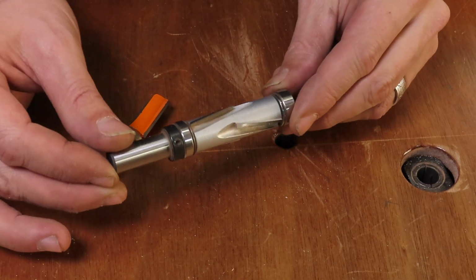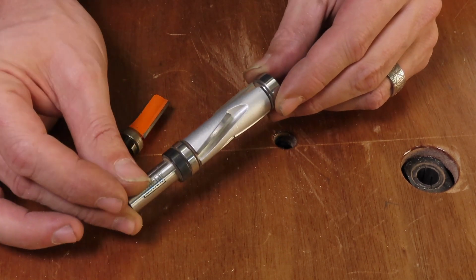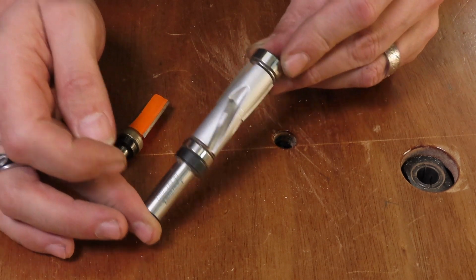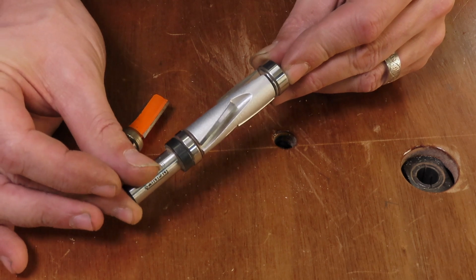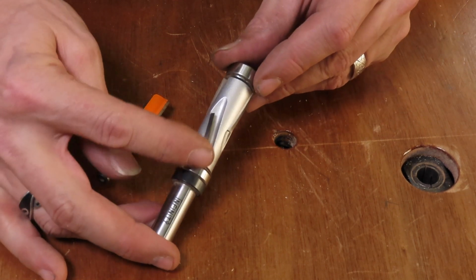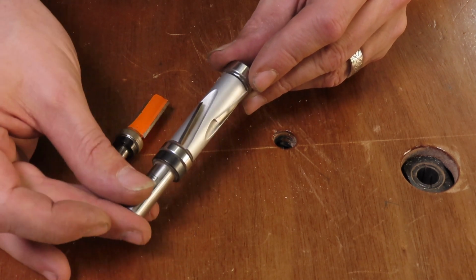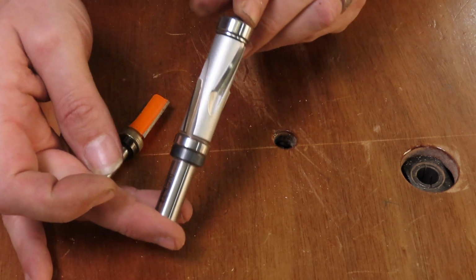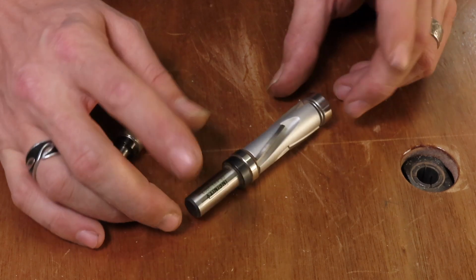Like I said, we're going to need some bearing guided router bits, and this is a bit from Infinity Tools from the USA. It was sent to me by one of my subscribers, for which I'm still very grateful. The benefit of this router bit, besides the double bearings, is that the blades are at an angle, giving a smoother finish and a smoother cutting action when using this bit in a router table.